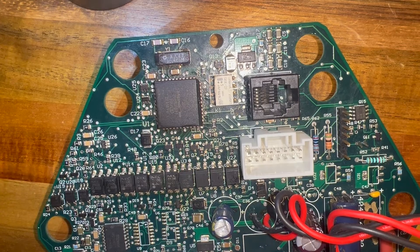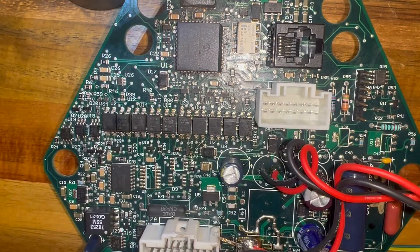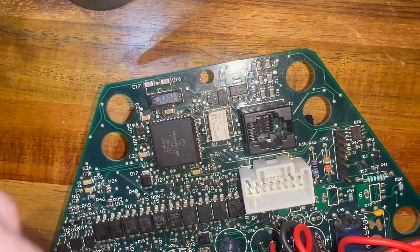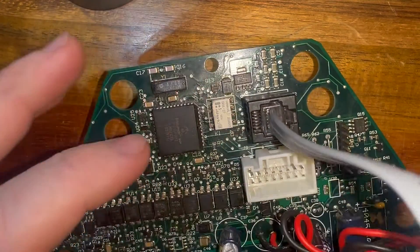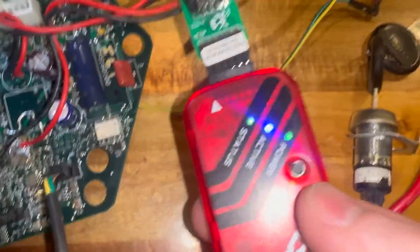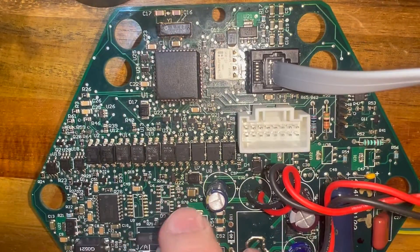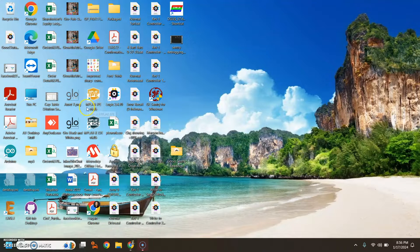The first thing you're going to want to do is make sure that your PICkit is plugged into USB. We're not plugged into any power — we're going to use the PICkit for power, so just plug this in here. You should see your power and your active icons on. Then let's switch over to the computer. You're going to want to download the Microchip MPLAB IPE. This is part of the MPLAB IDE, which you can find on Microchip's official site. I'll link to it in the description. The IPE is what you're going to want — it will let you flash the hex file.